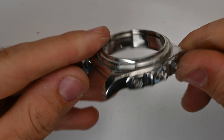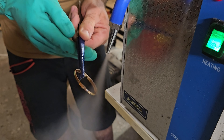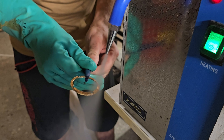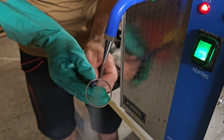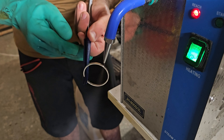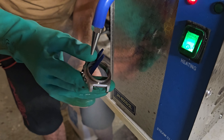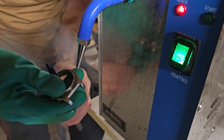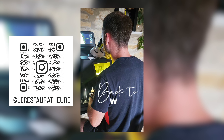We can see there is a lot of grime. I use several machines: the first is a steam machine. You can see each element being cleaned, and also the ultrasonic machine which allows removing all the impurities inside the case. The idea here is not to make it perfect, but simply much cleaner than it was. After that, I can finally work on the laser.